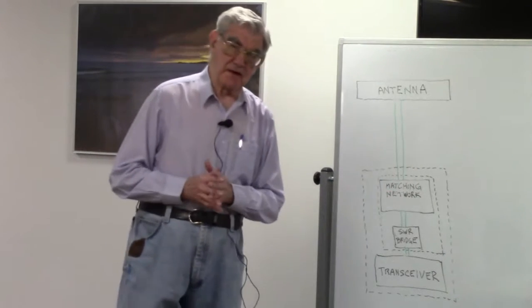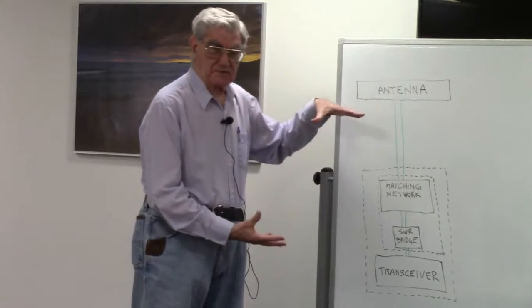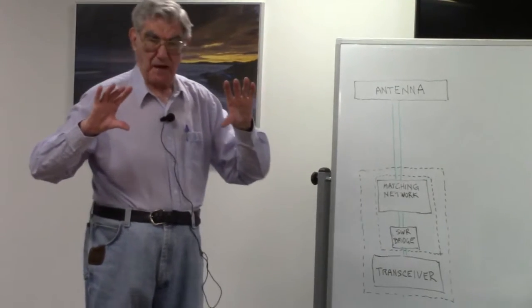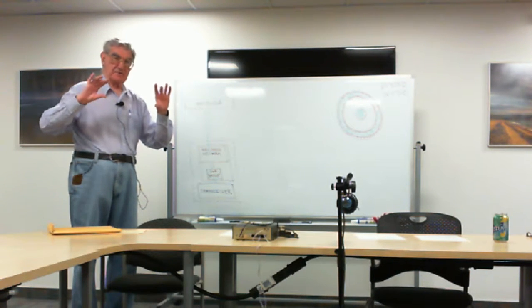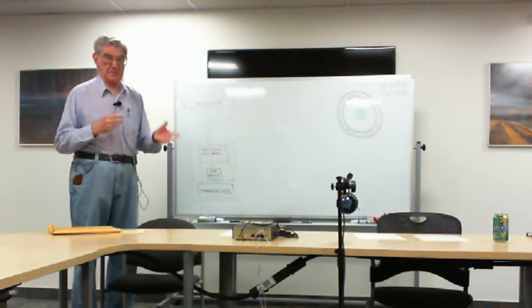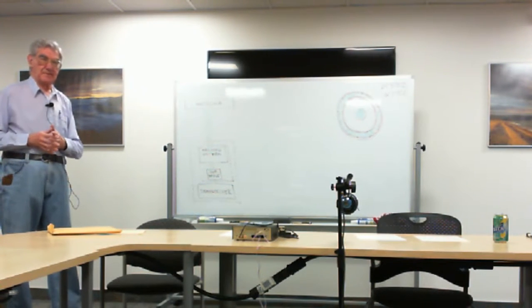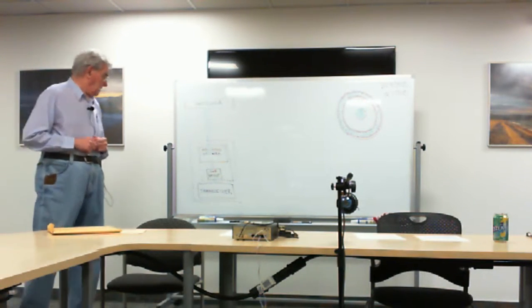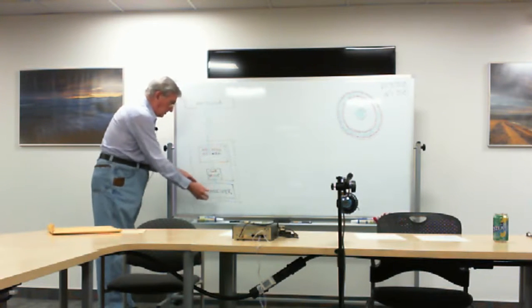It's rather interesting that in my station, I have a setup where both of these are separate. And the SWR bridge is quite a modern automatic one built by the Elecraft people that does use diodes and is actually auto switching as far as power is concerned. Very, very handy if you want to switch from low power, say QRP, to ordinary power. Mind you, they don't sell those things for pocket change. I think this one costs pretty close to $300, but I really like it. But it is very common these days to put all of this inside the transceiver.